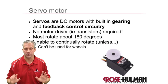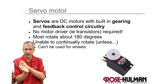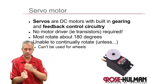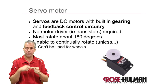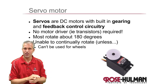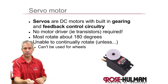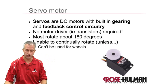The idea of a servo is that it's a very different type of motor. Typically servos can only go about 180 degrees total — that's how a servo motor is supposed to work. They have a feedback system inside, and they also have transistors built in, so they're really easy to use. There's one wire that goes straight to your microcontroller, no external transistors needed. They have absolute position, so if you want to go to 30 degrees, it just does it.